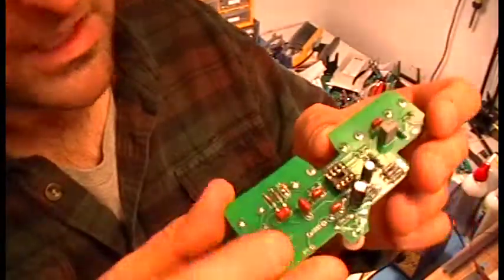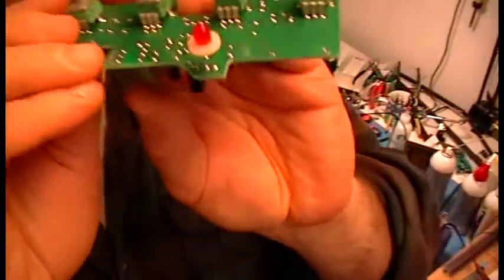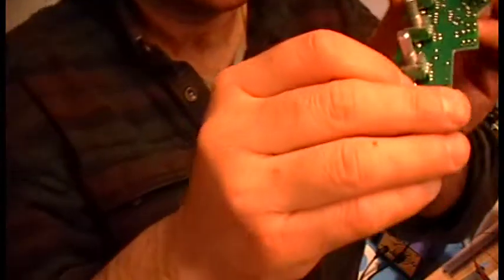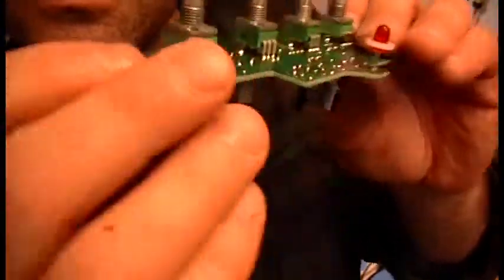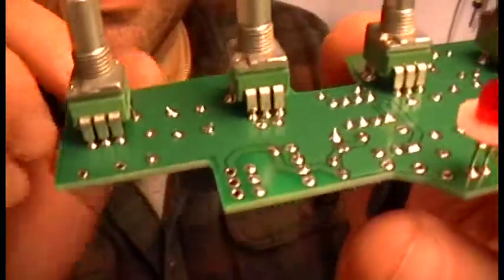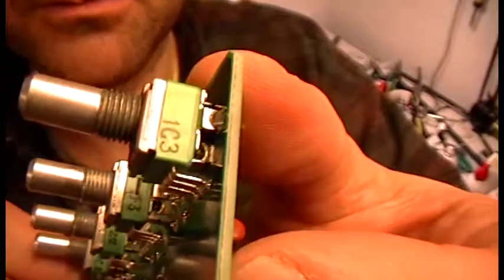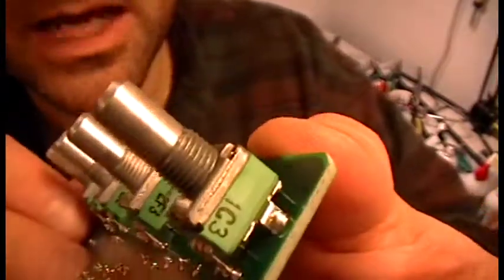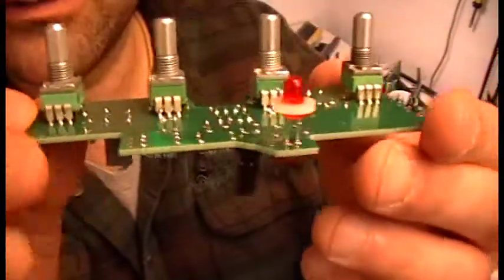Now we examine the LED, make sure it flows through, and just check everything. Check what I just soldered to make sure it looks good from this side — check that it flowed through to the other side, which it did flow through beautifully. Check the mounting lugs — those big honking pieces of metal actually flowed through to the other side. Now look at the thermal capacity on that JBC iron. I was monitoring the temperature on the station while I did that — it didn't move one degree, absolutely rock solid. This thing can dump heat into a joint like you wouldn't believe.